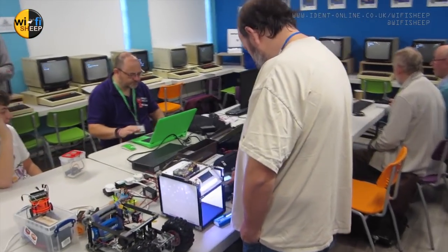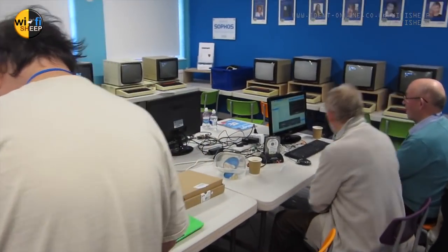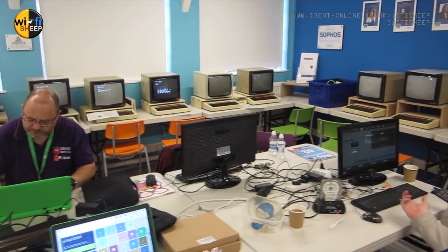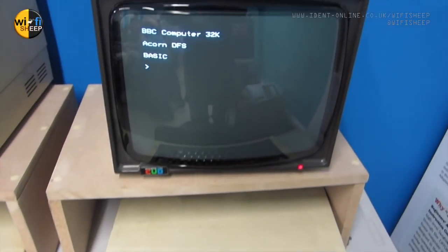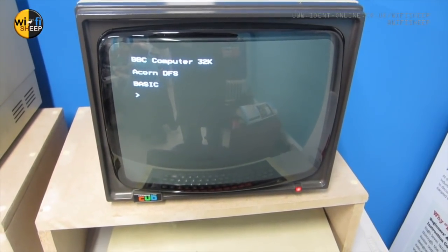We were being hosted in the 1980s classroom, which was full of BBC Micros identical or near-identical to my own, and they offered me a cub monitor. Under normal circumstances that would be fine — one of my first videos was repairing a cub monitor. However, this particular Model B has an NULA graphics card fitted, which means it outputs in analogue RGB, not the digital TTL logic that cub monitors need. So it wouldn't plug in and needed a SCART-enabled RGB television.